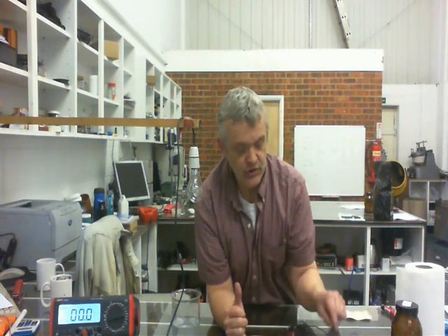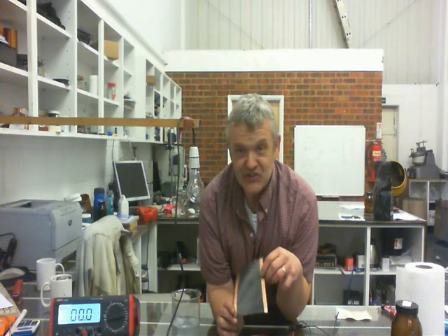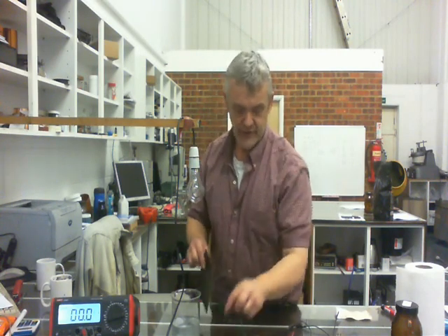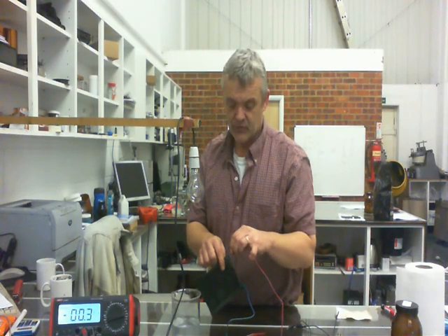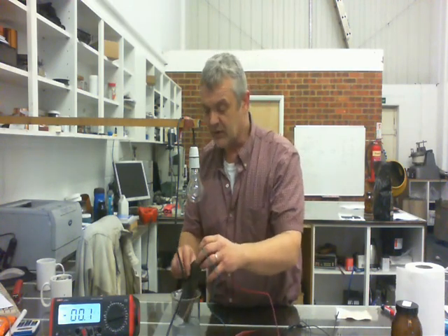So there's something we need to do in order to improve that. My first thought was to use this structure — this is where we've got two coppers. So we can't get a metal-to-metal galvanic reaction because we've got the same metal, but the copper obviously runs down with the lines, so that's acting like a current collector. We should get a better result from this because we've got a way of collecting the current, so the resistance of the device won't knock everything out. So we connect up our current collectors and dip that in, then we get a much better reading.